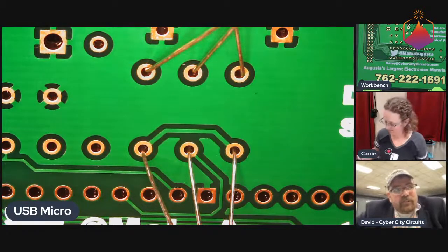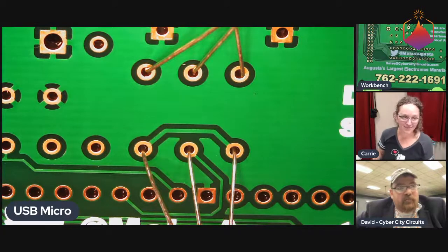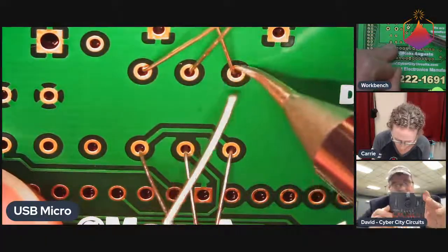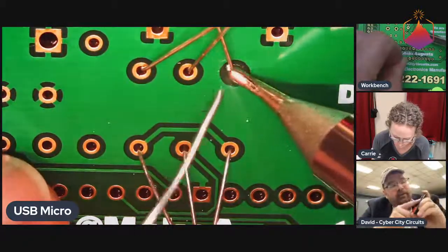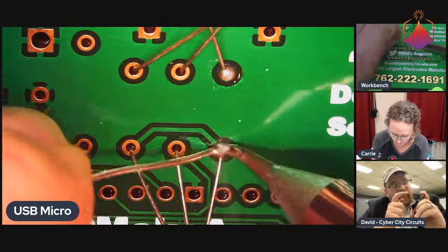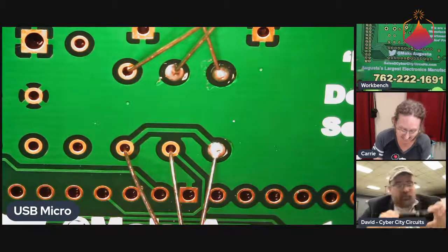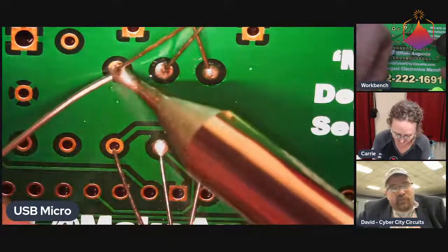When you have a development time that's like 28 days to ship, you don't have any room for error. If you make a mistake, there's no fixing it. So on this example, I ordered 150 of these boards for the kits. And on the ultrasonic sensor, I had ground and VCC switched. Oh, no. Which meant that when my ultrasonic sensor was plugged in, it burned and melted the 328 on my Nano. Oh, shoot. But you don't know that at first. You're sitting there with the computer and you just start smelling something.